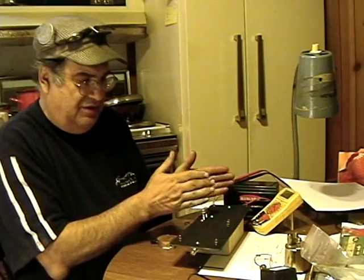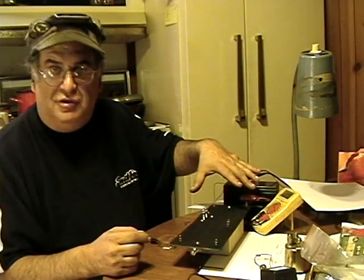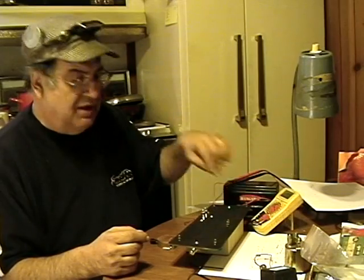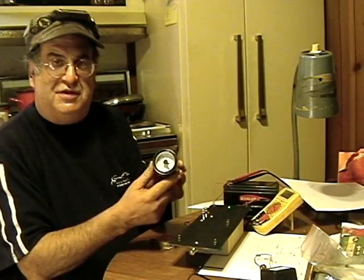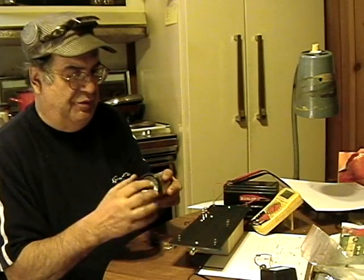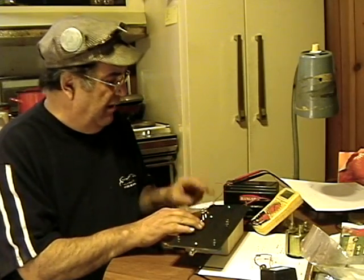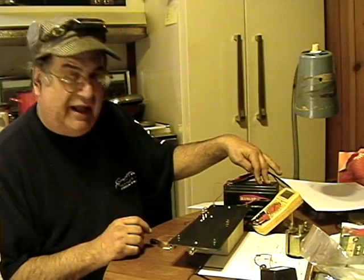This is a representation of the locomotive, the tender engine here and the tender here, and all the various lights — the exact bulbs I'm going to be using on the 1361: headlight, marker lights, cab lights. These two are an on/off switch, rear markers, and the rear backup light. These two large ones are going to be used for some air gauges I have on the locomotive — duplex gauges with two needles, illuminated. There are two of them right down on the tender; you look straight down and can see them, and they need to be illuminated as well as the cab lights.